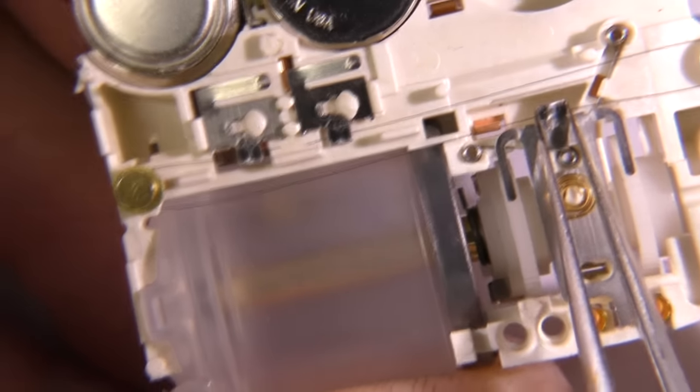That's about 2000 full ratchets, probably 4000 half-ratchets for the full cycle. So if it empties the whole chamber within that three-day period, that's roughly one click per minute. That's a really interesting little bit of tech — the electronics were pretty uninteresting with nothing surprising, but the mechanics are just fascinating, with all those little details. A really clever way of producing a very small amount of motion with very little noise — no motors, no magnets — just a really simple, elegant application of shape memory alloys.